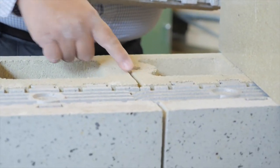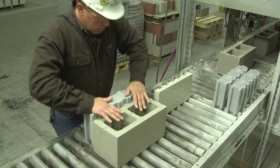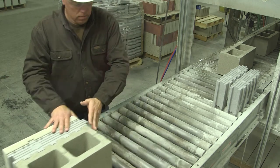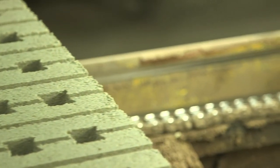Here we see an example of the shiplap with two units side by side. One thing nice about this product line versus other insulated products we've tried in the past is that we make the structural blocks separate from the veneer faces. That gives you the ability to make a cost-effective backup block and put a high-end finish on the front. We're offering the Insultec in the Trenwith line, which has probably 100 different mixes — we can produce 15,000 blocks in a day easily.